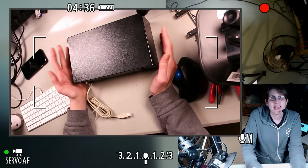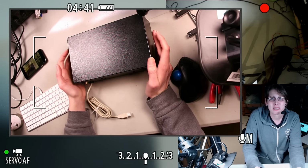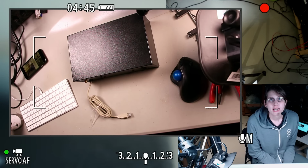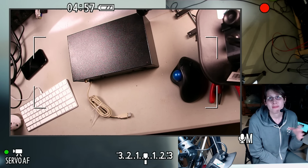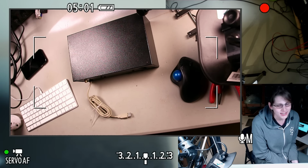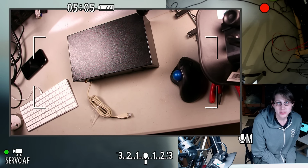So with this project, I had access to the full glory of low-speed USB with 1.5 megabits, which actually had a lot of restrictions. It didn't have access to the normal USB time-based start-of-frame packets that full-speed and later devices get every millisecond or every eighth of a millisecond for synchronization. So the packets just kind of come in this little stream, as they're needed. It only supports a couple of the transaction types.